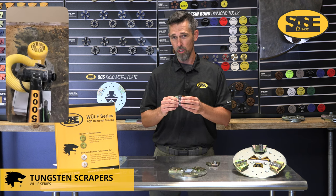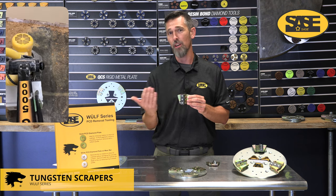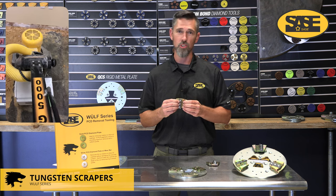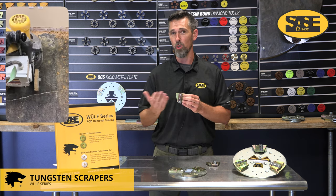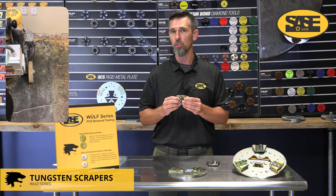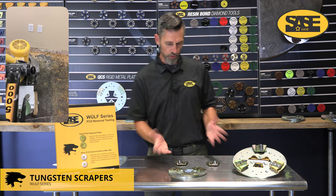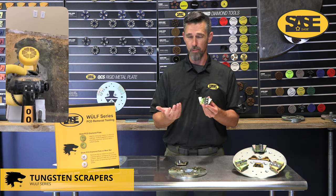For thin rubberized membranes or failing coatings, these work really well — they chip it off nicely without gouging the floor. Some people actually use this when a customer wants a CPC Class A finish — a cream finish — where they don't want to see any salt and pepper or aggregate. This will scrape off whatever's on the surface and then you just follow it with maybe an 80 grit metal bond without grinding too deep to show aggregate. They're set up to go both directions, and usually we'll run three all together on heavier machines like the PDG-8000.